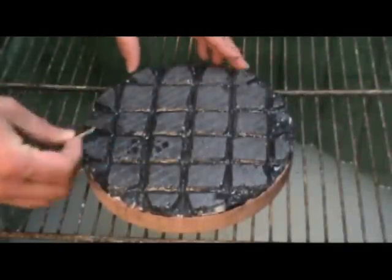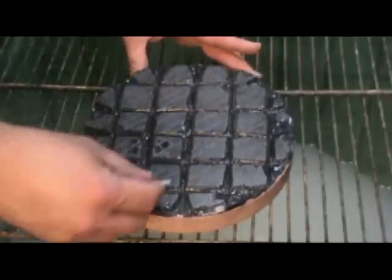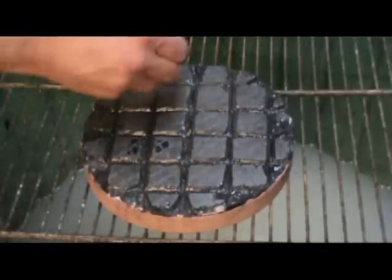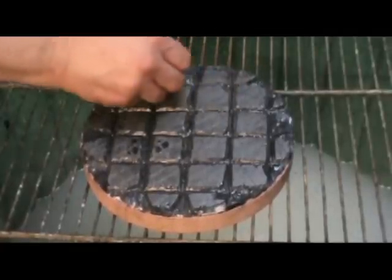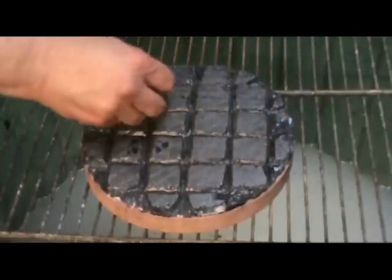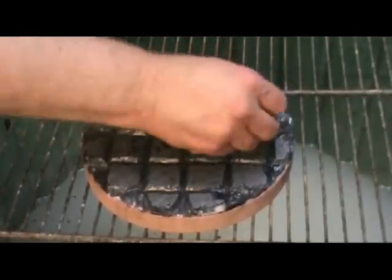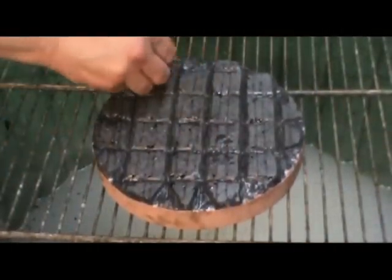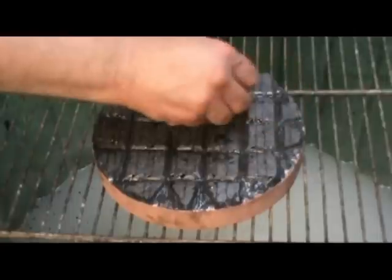The first thing I do is take a straight razor blade and put some micro-faceting in the tool. I do this just by making scratches on the surface. I like to put one or two or three in every facet and you can even just draw them along the surface like this.